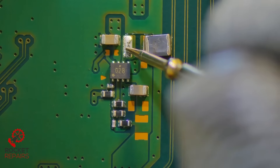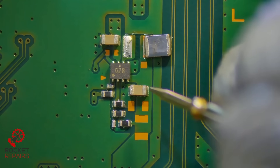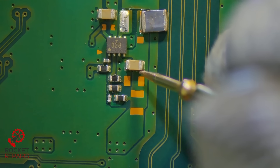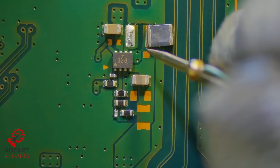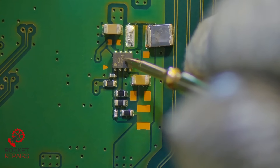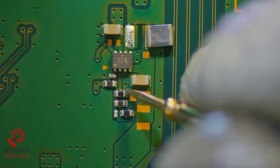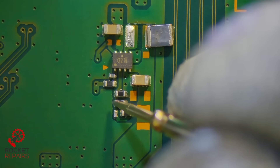Has that relieved our short? Oh, it might have — but we still have a short here I think. Wait — I was completely wrong. This is a different circuit. This actually isn't meant to be grounded at all. I don't think this side or this side is supposed to be ground, but they are still both grounded. So this was carrying the short over here. I don't think it's coming from this component, so that component can go back. We have the short here and here, but on the other side we don't have the short.